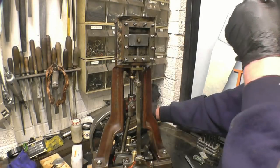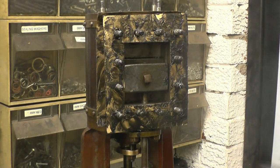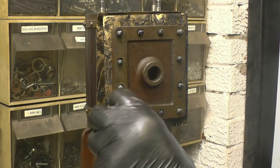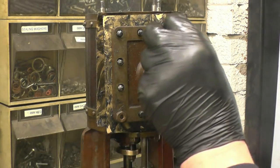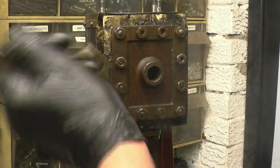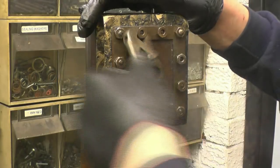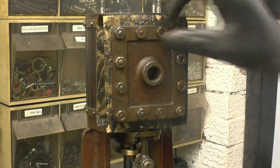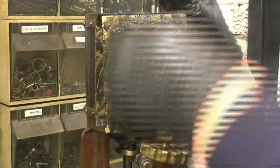I think what I'll do is parcel it up and put some compressed air on it — I can't put steam on it — just to see if we can get it running. I want to make sure I've actually got a couple of bags of quarter Whitworth and 5/16th Whitworth nuts, which is ideal because modern nuts just don't look right on here. I've actually got a 5/16th Whitworth spanner. Let's go — valve in there just so it can regulate the compressed air into it.